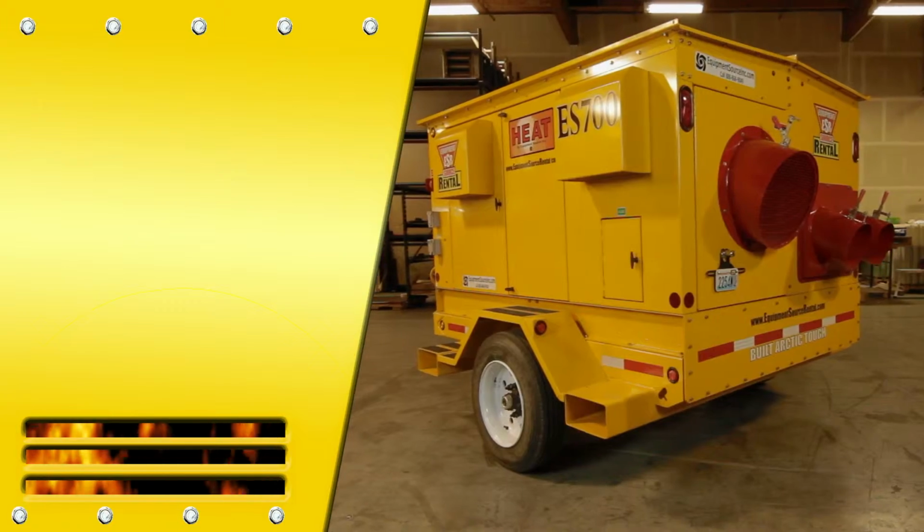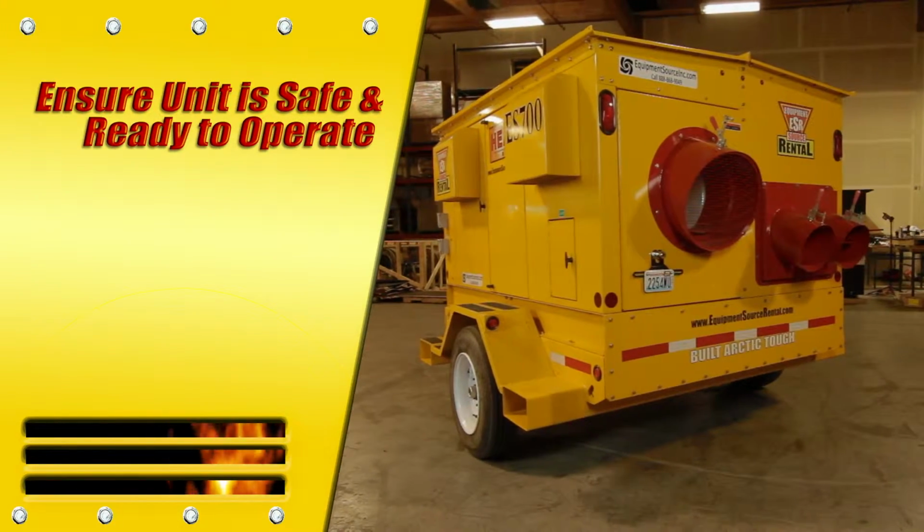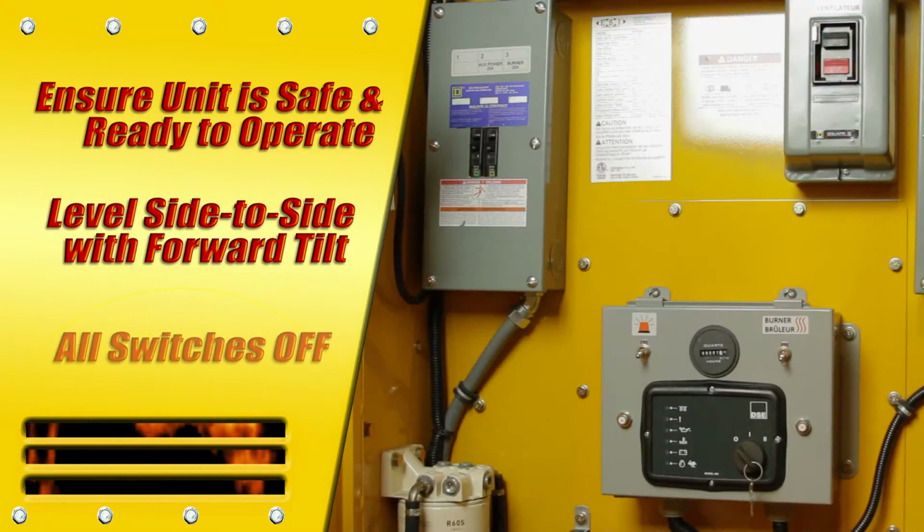Let's begin. To start the ES700, first inspect the unit and ensure that it's ready and safe to operate. Make sure it is level side to side with a forward tilt and check that all switches and circuit breakers are in the off position.